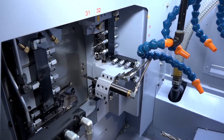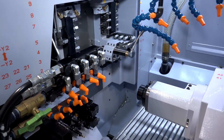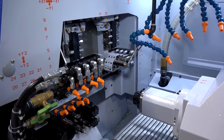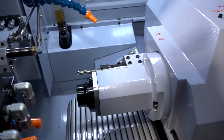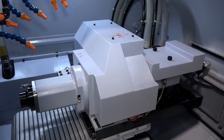As well as the B axis, we also have a Y axis on this machine for the back working spindle, and this also has six tools as you can see here. On the front spindle and the main spindle of this machine we have 10,000 rpm, and the driven tools within the 41-tool complement have a maximum spindle speed of 8,000 rpm.